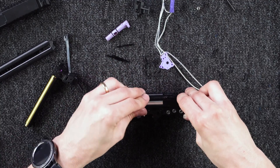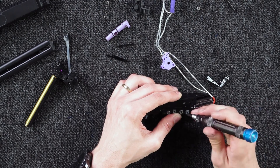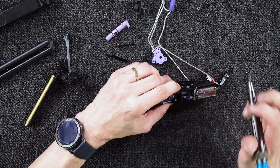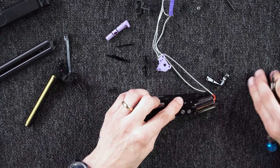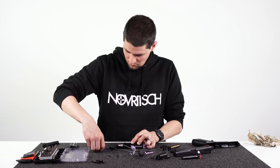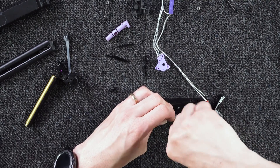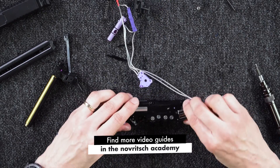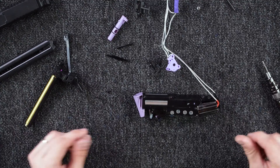Then I move to slowly close the gearbox. You need to align the wheels and everything so that the gearbox can close, and you can do that with a pointy object to align all the little wheels. Also the spring guide — at this stage it's like this, so you just push it back into place and then it should close nicely. Just to make sure that it doesn't fly off, we can immediately put back in one screw. At this stage we can check that the gearbox is actually fully closed — if you don't see a space here, then you've done a great job. Now we can move forward with installing all of the screws back in.